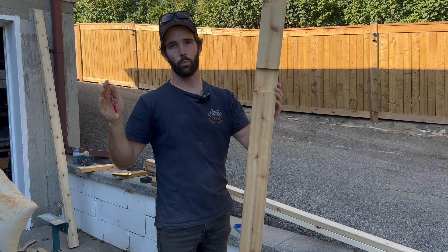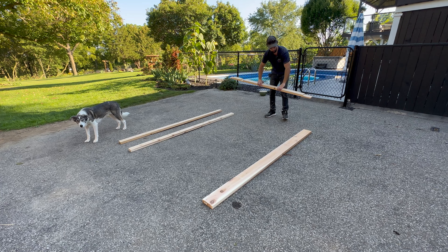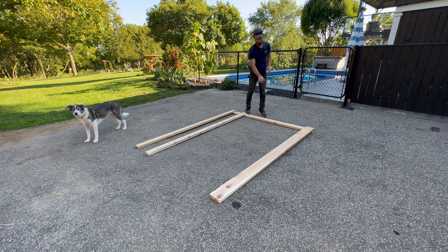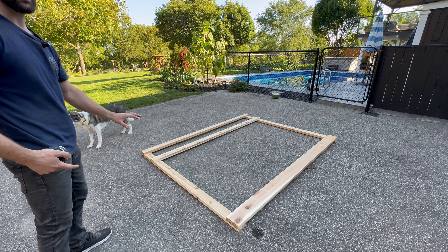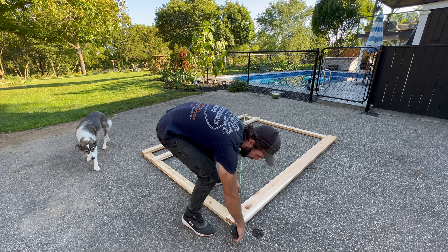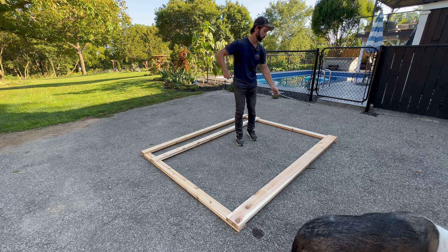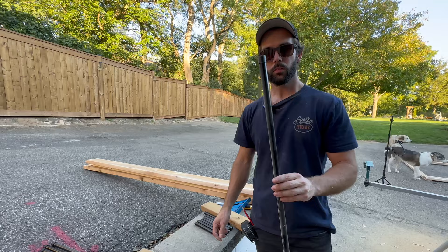To give you an idea of what it's going to look like: I have two of the sides notched out already, with fence boards going vertically up to the top, and then we're going to use three-quarter-inch black metal balusters along the top section. When we're ready to put it together, I'm going to glue everything and screw it from the back side so there are no visible fasteners on the front. As you're gluing and screwing it together, check it for square — measure corner to corner and the numbers should be the same. These are the metal spindles we're using for the top section of the gate.